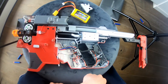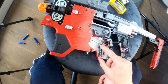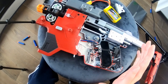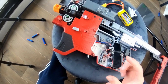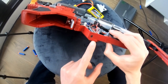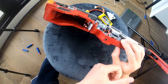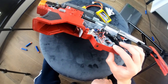This is a third-party Arduino Nano — I killed a couple of genuine Arduinos. You can use any Arduino you want; the only reason I use the Nano is because it's small and compact and can fit inside this Nerf blaster. On the bottom you can see there's a USB port, so I can plug in a USB cable from my laptop to upload code without having to open up the entire blaster and take all the screws out.